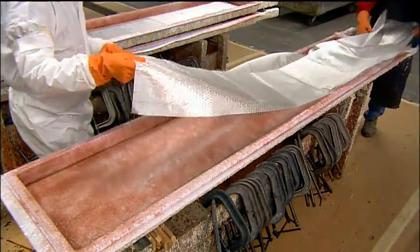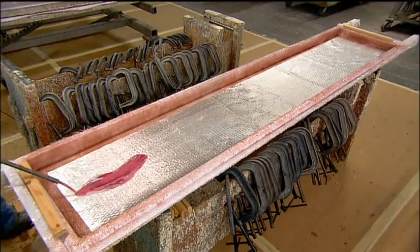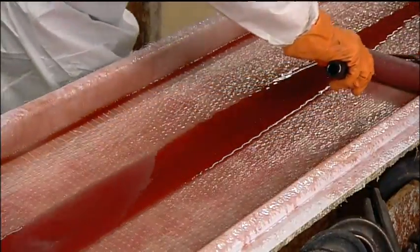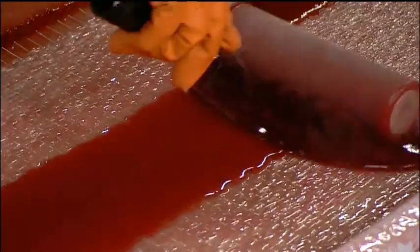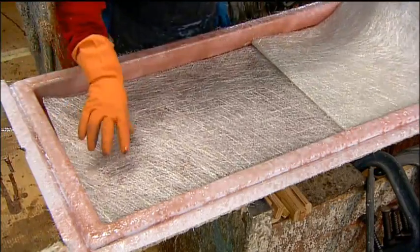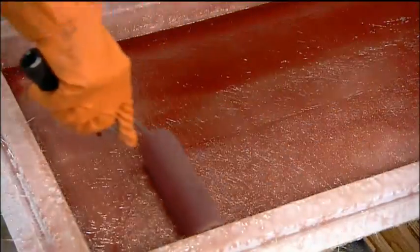After letting the resin dry and harden for 30 minutes, they begin filling the shell cavity with half-centimeter thick fiberglass mat. They drench the mat in resin, rolling it all over to ensure every millimeter gets well saturated. They lay down another fiberglass mat, this one a bit thinner, and saturate it with the existing resin.